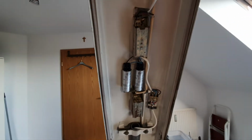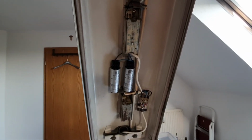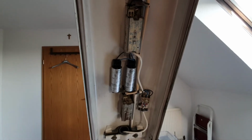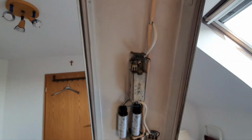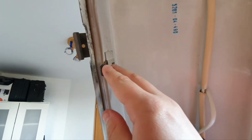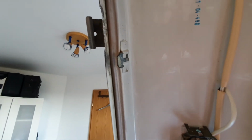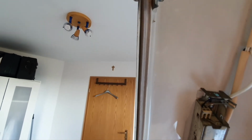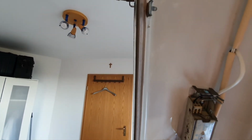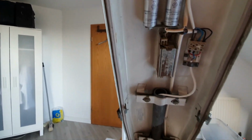And you can still very easily get the fluorescent tube, so that's no problem, like with the mercury vapor that was banned in 2014 or 15. This is not banned, so they just keep using it. Maybe another little detail, there are these little hooks here, 4 of them, and they are supposed to keep the bowl from falling out, but as you have seen, you cannot rely on that really because it just falls out. Maybe I have to bend them a little other way, more towards the bowl, so that they work better. Well, let's reassemble the fixture now.